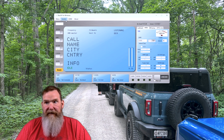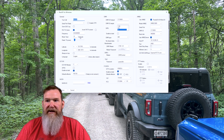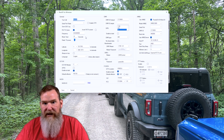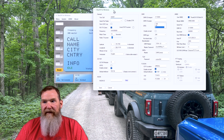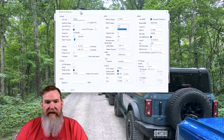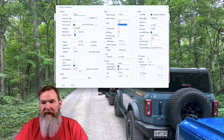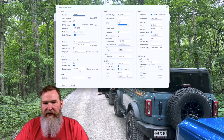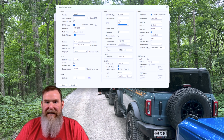Once everything is updated, go into Setup. The general tab has information for RF use if you're using this with a local radio, but the only thing we need to do in the general section is add our call sign. For the D-Star section, decide whether you want to enable the D-Star service at startup — that's whether the tab is switched on or off, or you can do it manually — and set your default reflector. In my case, I've got Reflector 30 Charlie, one of the more popular ones on D-Star. For NXDN, all you need is your ID.